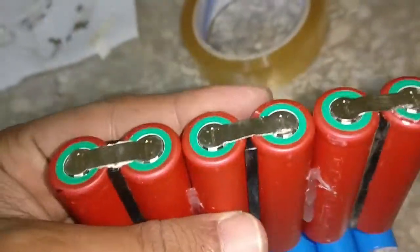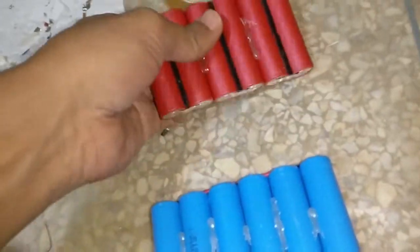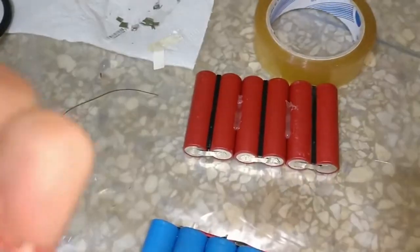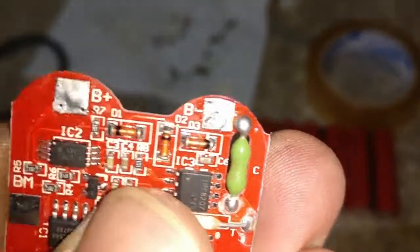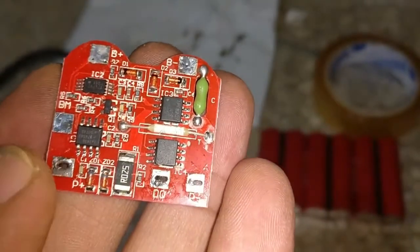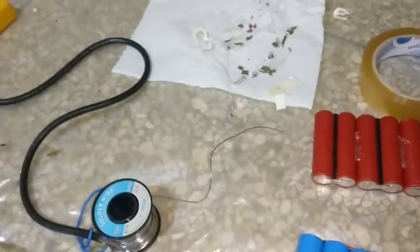We're gonna put them in series with another group of six - I still haven't soldered the wires to these yet. As I said previously, the plan is to connect these two groups in series and then connect them to one of these BMS circuits that is working. You can see on this one it has B minus over here, B plus, and then BM which is the middle connection. That gives you B plus and B minus output, and DQ is some kind of temperature connection.